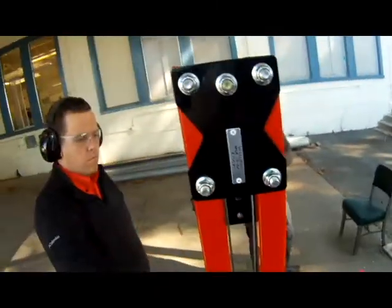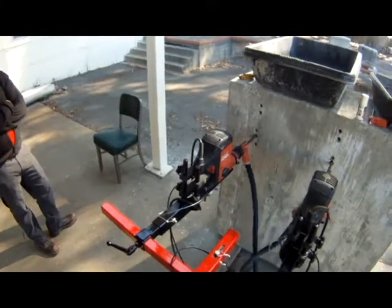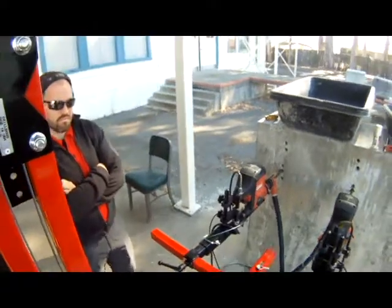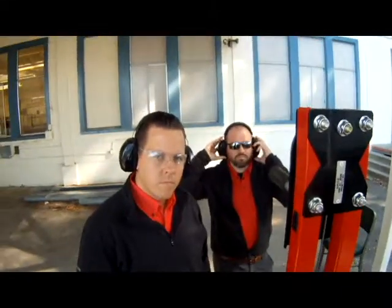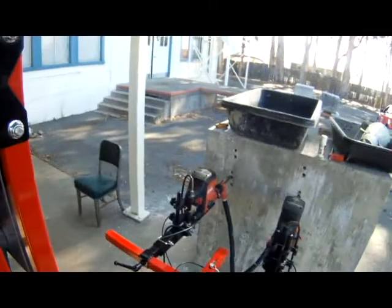See how these pins change? Based on the pressure, operators can get a sense of how much pressure they're putting on. It's pretty important for overhead drilling, where there's no slip, it's all compression. In a horizontal drill, it's not that important because you're going to have your break free.